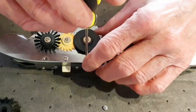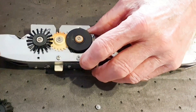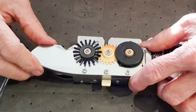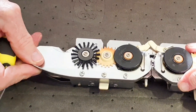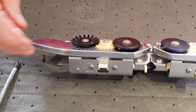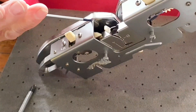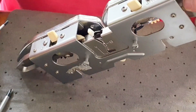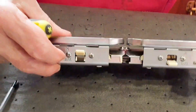We call them wings because that's what they look like to us — that's not the correct name. The name in the parts catalogs is actually sinker plate right and sinker plate left. With two screws in, there's still a lot of movement. It's amazing, but these sinker plates get dropped upon occasion. Look at how much movement we have inside of there — what's important is this critical distance here. These two have a common surface right there that has to be kept, but these three planes can become bent, sometimes in shipping. We aren't making a video about straightening these because components are still available, and it's very, very tricky — you'll break them.